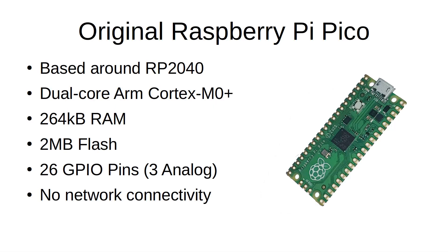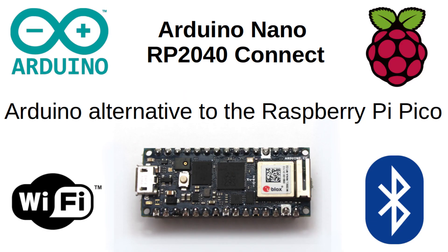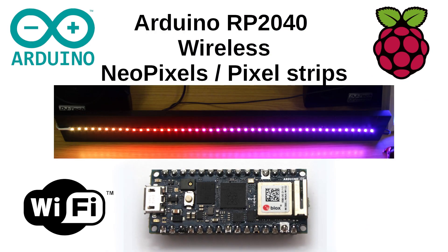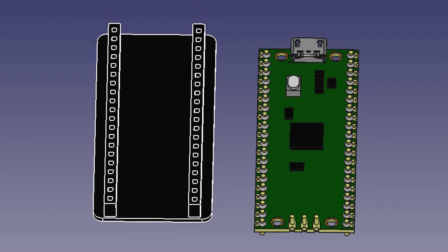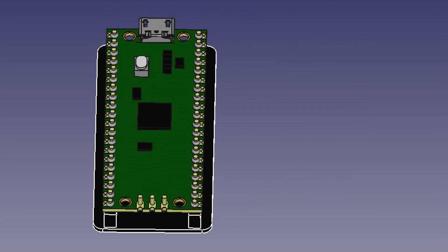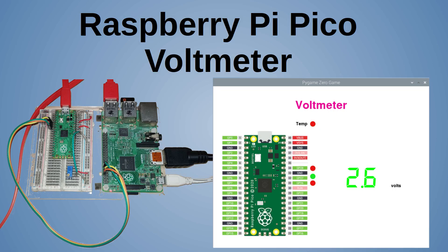When the Pico was released, the one thing that was lacking was connectivity, which has restricted its use. At a time where everything is going online, it was frustrating not being able to connect to the Pico using Wi-Fi. There have been some ways of getting the RP2040 to connect to a wireless network. The first is to use a board which combines the RP2040 and the ESP32 wireless module — exactly what Arduino did, and I used that for a port of my wireless pixel server project. Another is to combine a Pico with an external ESP32, which is something I used with the Pimoroni Pico wireless pack. You could also pair the Pico with a Raspberry Pi computer, which I've demonstrated using UART but also available using SPI or I2C.